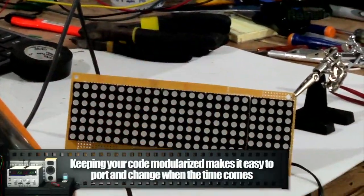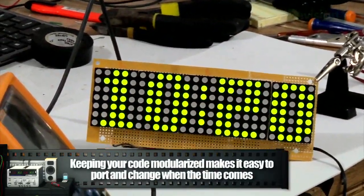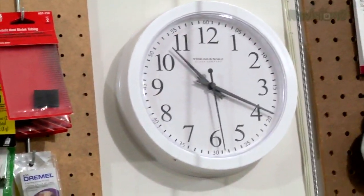As mentioned in the Aaron Matthews episode, the RTC uses binary-coded decimal, so the clock doesn't give you the number 25 for minutes — it gives you a two and then a five, which makes it easier since we don't have to split digits ourselves. I've modified the real-time clock code from the Aaron Matthews project to display on the LED matrix instead of the debug LCD. There's the time: 10:20. My wall clock is a little slow, but there it is.